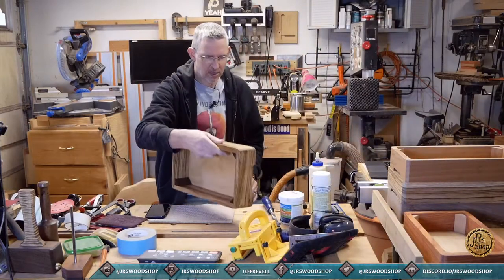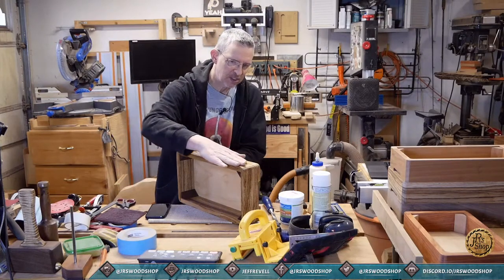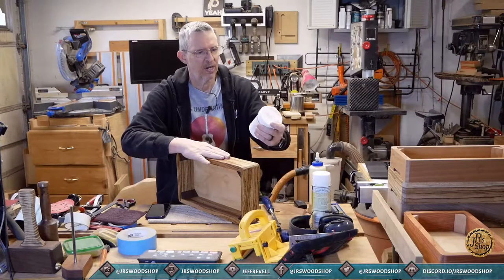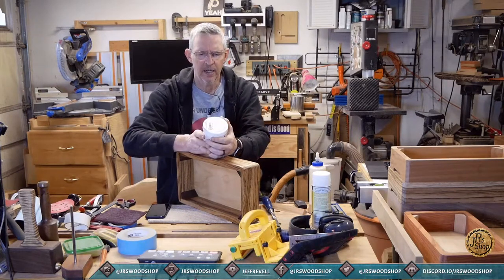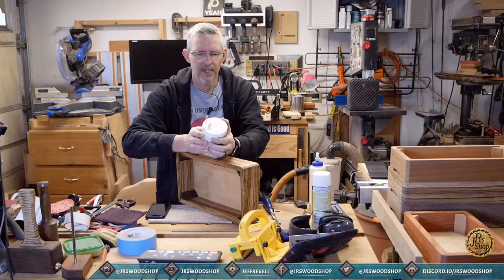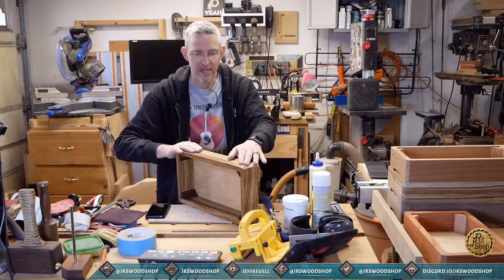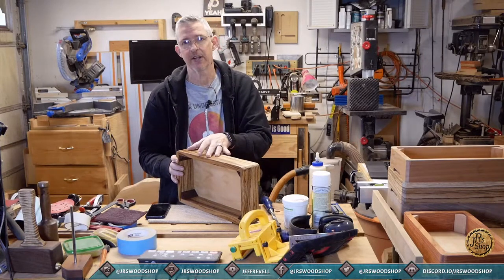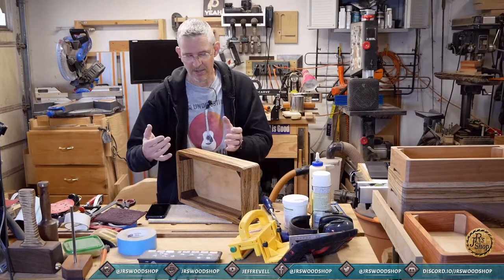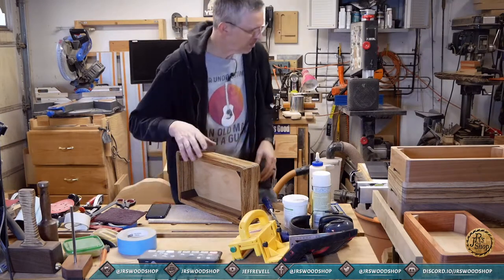I think what I want to do is take my little sanding pad here and clean all of the shellac off of here. And we will break out our wood grain filler. I don't know how long it takes for this stuff to dry. It says let dry 30 to 45 minutes, and then sand it with a 320 or finer, and then do another one. It says only 2 or 3 coats are recommended. So 2, probably 3 if you really need it, maybe 3 coats in areas where you have the largest gaps in the grain would probably be acceptable.